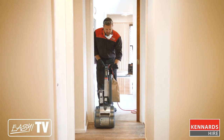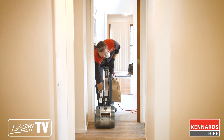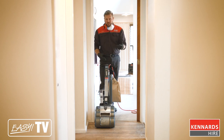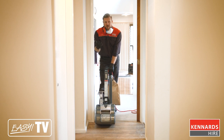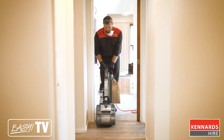We're about to get into the sanding. We've installed the sandpaper, we've got our dust bag on, the handle's already adjusted, ensuring that the clamp is nice and tight so it's not going to come loose as we're operating the machine. The power button is here, but the very key thing is you need to always tilt the machine back so the sanding drum is up off the floor while you're either starting the machine up or finishing as well.